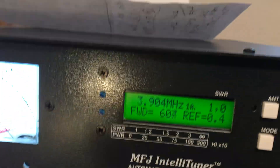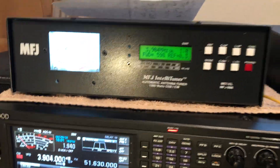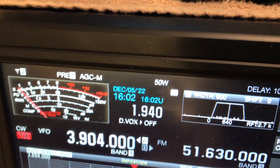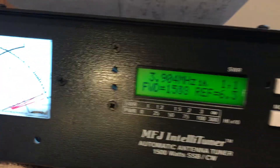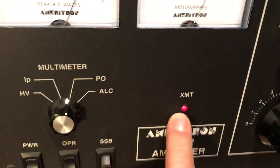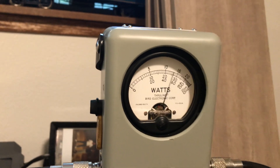It's putting out about 500 watts. There's a little inaccuracy with the meters between the MFJ and the Bird — that's to be expected, about 1600 watts. So what we're going to do now is increase the exciter power until we get this amp to produce 1500 watts. You'll see it heading up there — 1500 — and then here we go. Bam, right there. It's in overload.